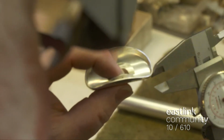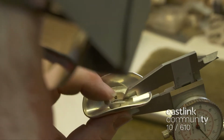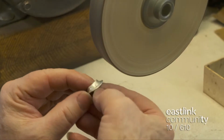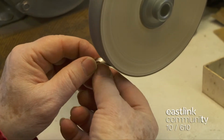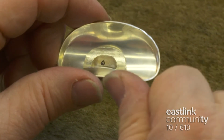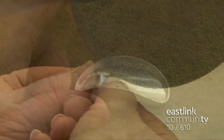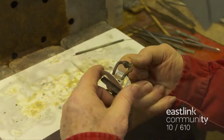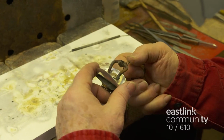Now the riser is measured relative to the lip plate. Sanding for depth, fit, and aesthetics, the riser is worked against the sanding wheel. Next, the riser is polished and checked against the lip plate again. The flute maker is working to accomplish the best possible fit at the right depth. The lip plate and riser are clamped in place for soldering.